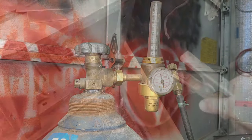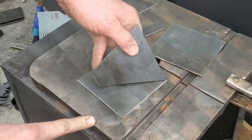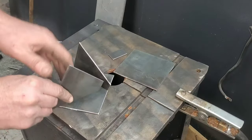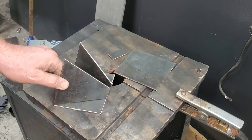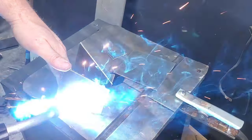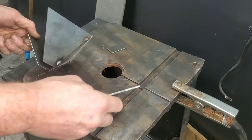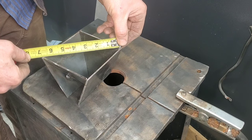I've probably got another project coming down the road — a welding table — but for now let's get back to this project. Now remember that geometry is important. As long as I line up that corner with that edge down there, everything's gonna be pretty much bang on. I shouldn't have to use the square, and I'm kind of testing this theory — it's a little bit more work. But the geometry does work out in the end and it actually does make the bottom of the triangle square. So I'm just gonna tack it together, and it's a good thing I tacked it together because I wound up having to rip it all apart during this no-square science experiment. And the geometry actually did line up — corner to corner it's only out a thirty-second of an inch.